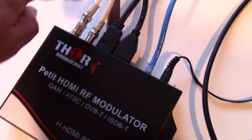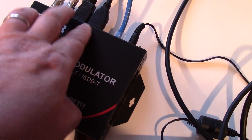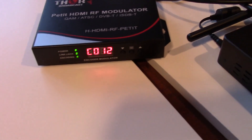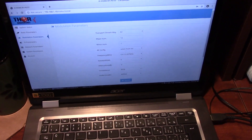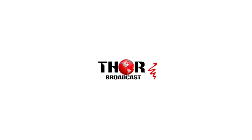So now we've got everything set up. I have my outdoor TV antenna going to the TV's ATSC connection, and I have the HDMI in, the loop out, and all of that set. I'm set to channel 12 — C012 — and I have an old router connected to a USB LAN adapter going into my laptop, because newer laptops don't have network cable connectors. When you turn your Thor modulator on without a video source connected, it will give you a white screen that says 'Thor' to indicate it's not receiving a source. When you do have it going, all three lights will light up at the front.